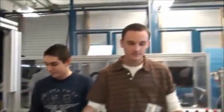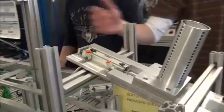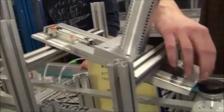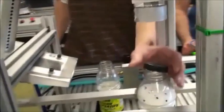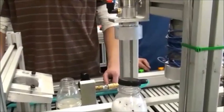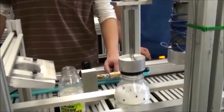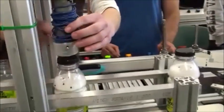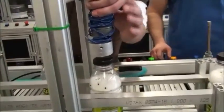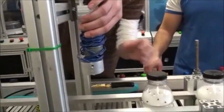The beads are going to fall, and then it moves on to the capping line. There's a cap mechanism here that will be attached to the air, and the cap gets placed on. But sometimes it goes on at an angle, so I made this thing here that slams it into place. Then it goes down to here — a motor attached to an actuator — and when it's spinning, it just has to come down for a quick second, then continue going down the line.